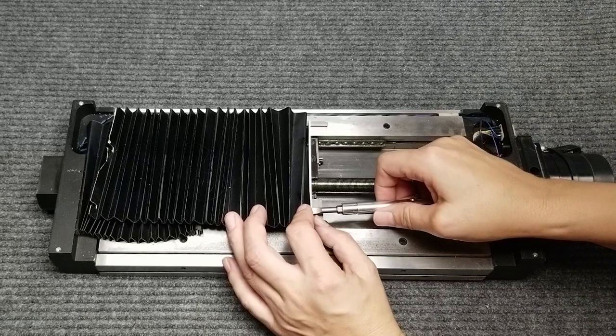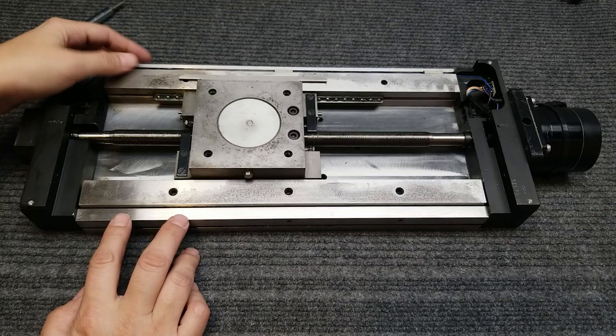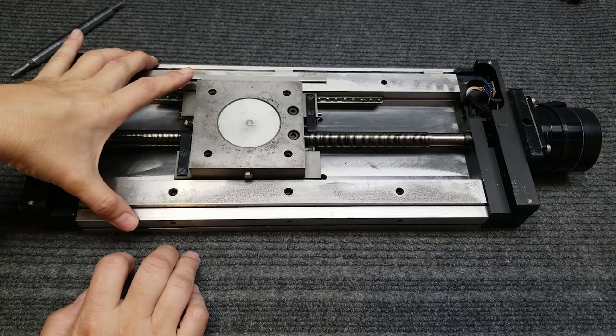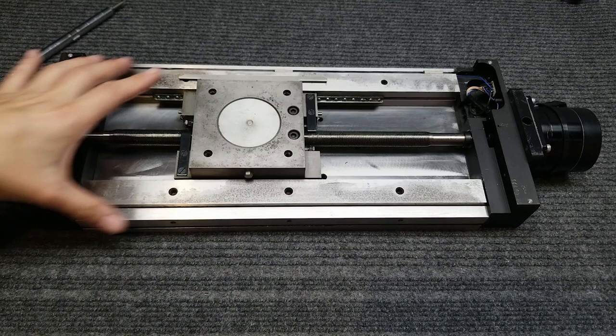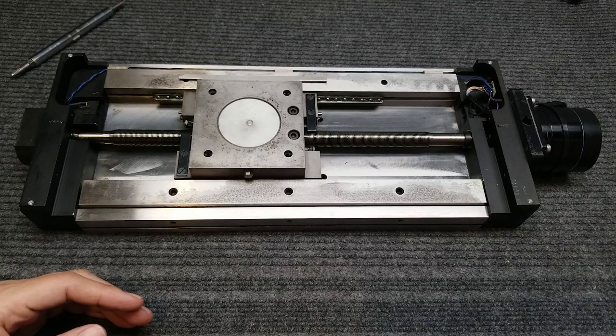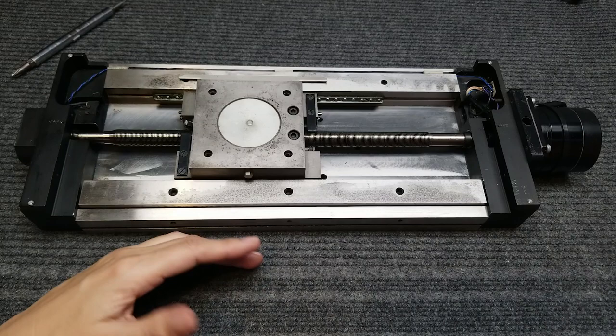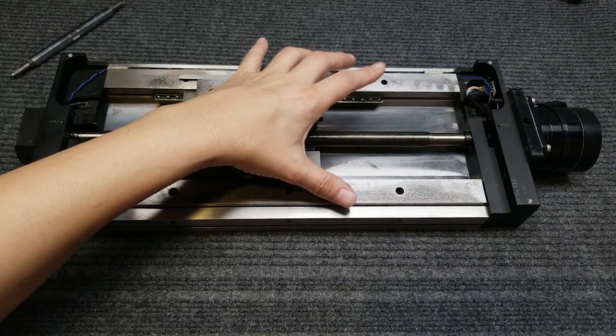I like this thing. They had a block of steel here and this seems to be wire EDM'd out from the finish of it. This was probably not cost-effective to make. There's a little staining here and I try not to get too crazy with the Scotch-Brite because it is abrasive and does change the dimensions. If I ever get rich, I'd like to have this thing reground. This thing was made to be stupidly accurate. These blocks screw in from the bottom and are held like that.